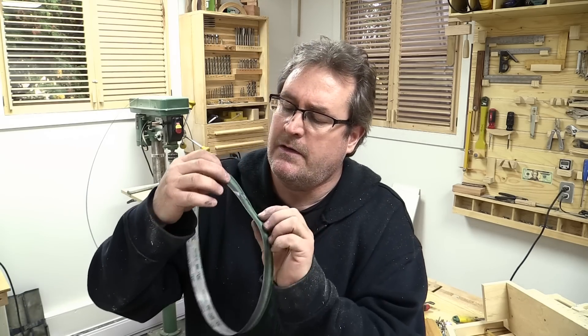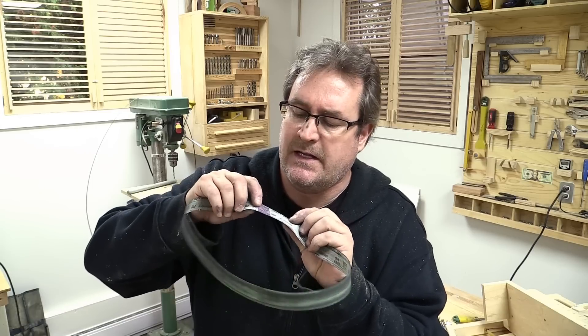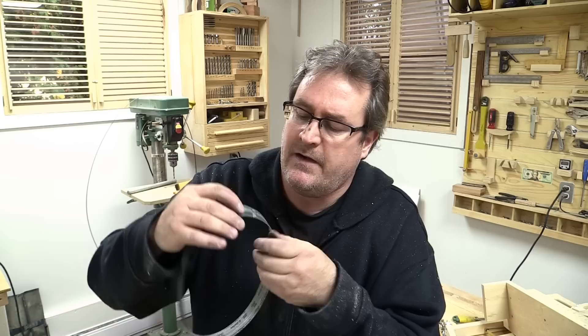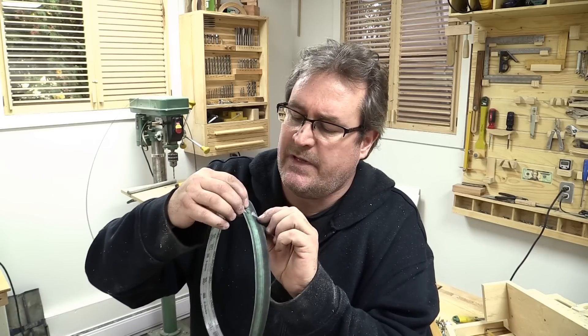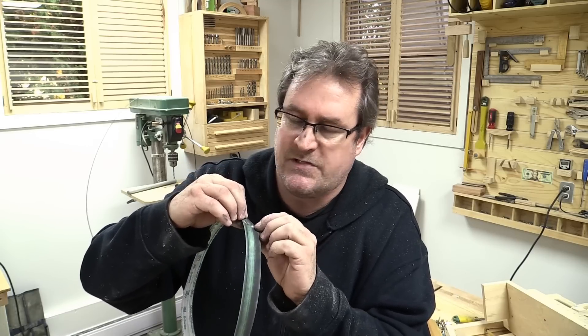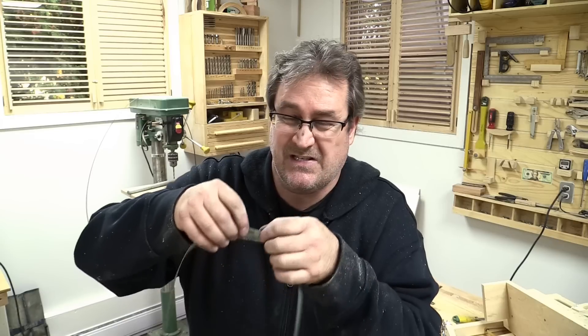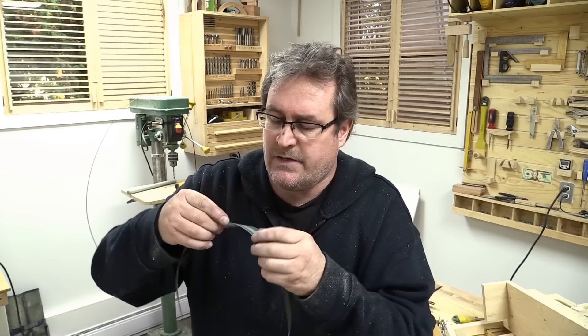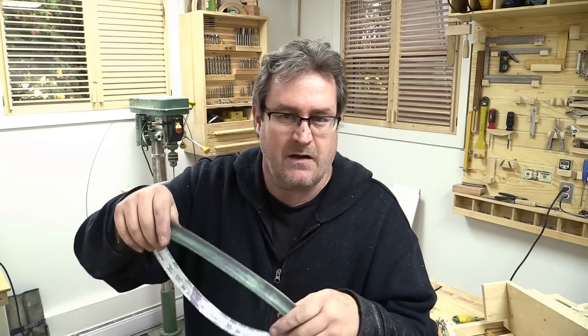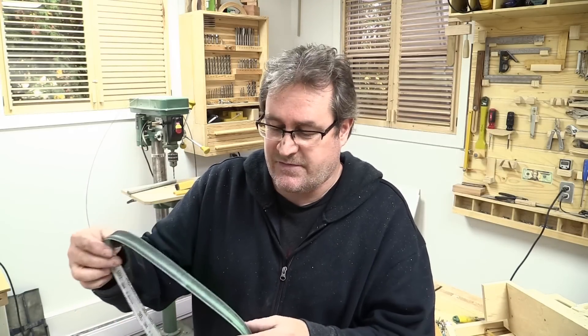Here it is right here — the tape they have on the back isn't that thick, but it's thick enough to create a problem. When the teeth of the blade hit that bump, they scrape all the diamond grit off, and I'm concerned they'll actually cut through it because it's paper thin. So I added a strip of packing tape to the back to even it out. These belts don't last forever — I've already sharpened a couple blades with this one, plus that biscuit blade. The carbide seemed to be really hard anyway, so well worth the 14 bucks.